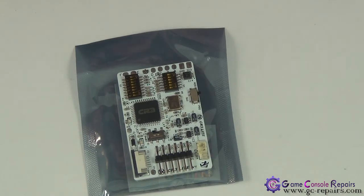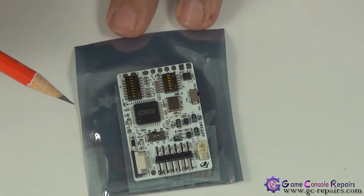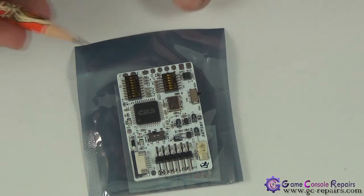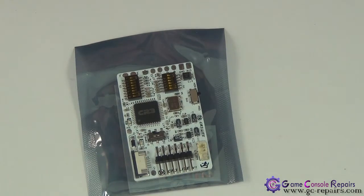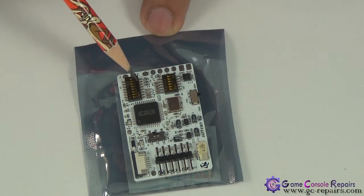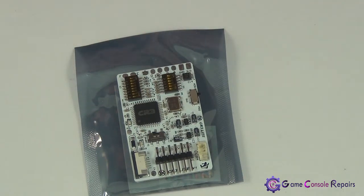Other changes that have been introduced: there are 2 switch settings, S2 and S4, which have been added so that you can fine-tune the glitch timings on your console. You can change the switch settings and see which setting suits your console in order to obtain the best glitch timing. We'll be going through all these settings once we are in the testing phase, trying a few different settings to tweak the best glitch time for our console.